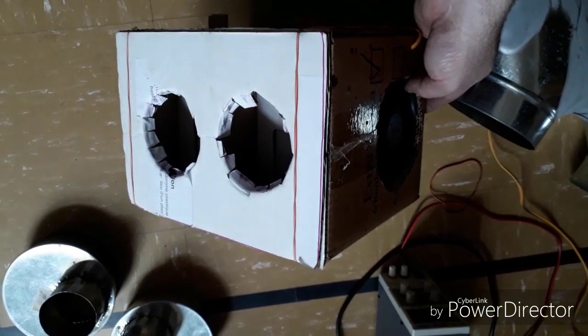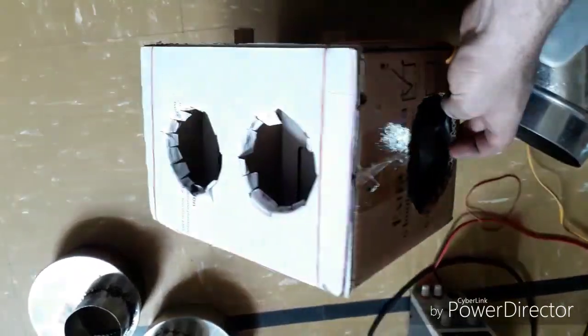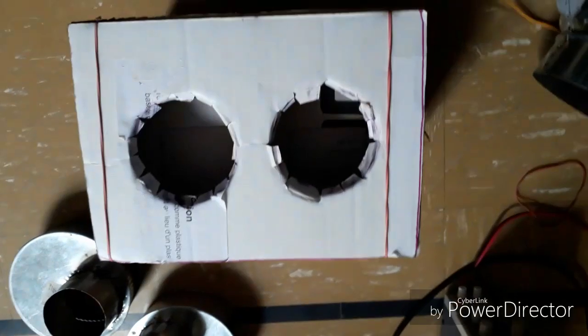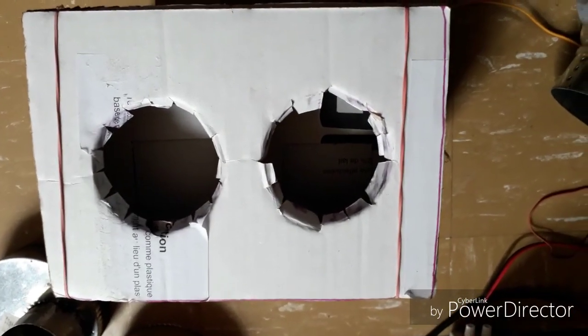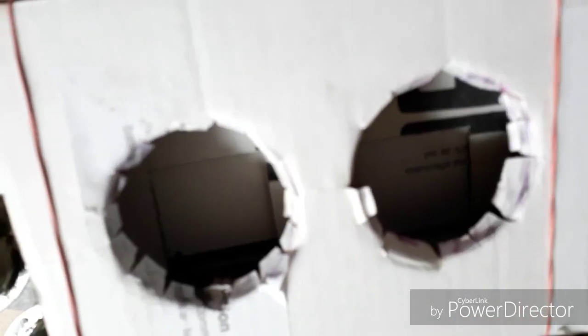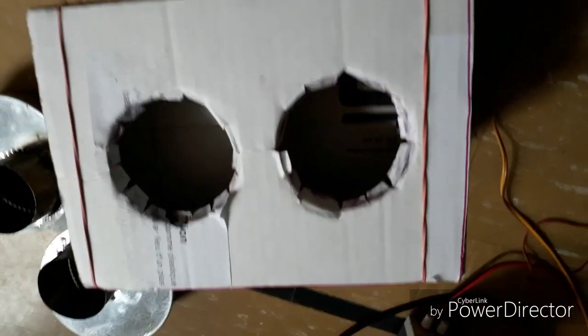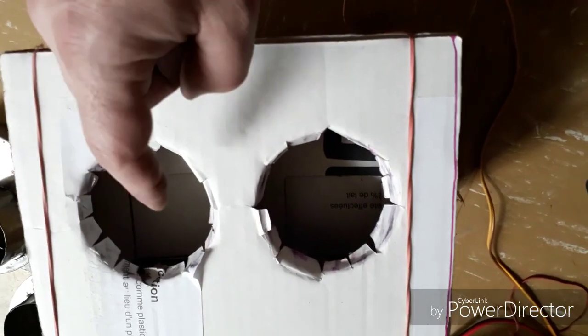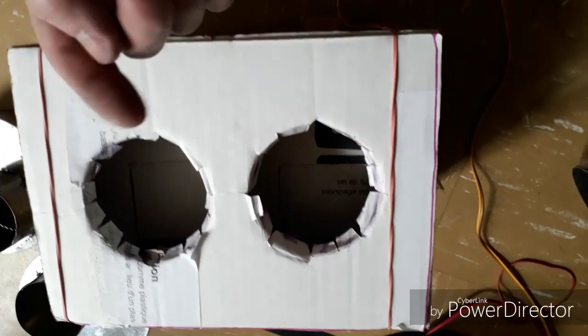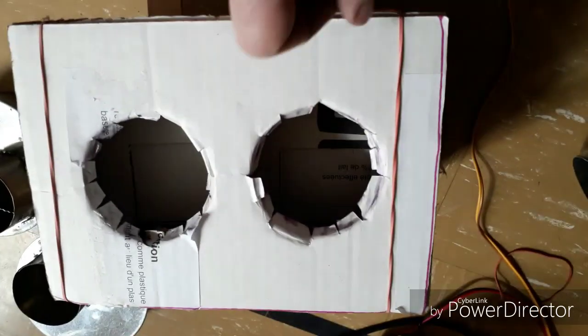The way I got over the airflow problem was I built this box, which is supplied by a fan here, so the box is pressurized by a fan, and then I have these two separate ports, and they're valved. These tiny sticks operate some valves which open and close the supply air. This way these two ports share a common pressure source, so there's very little risk of backflow. If I open one up all the way, there's still very little risk of backflow through this valve.